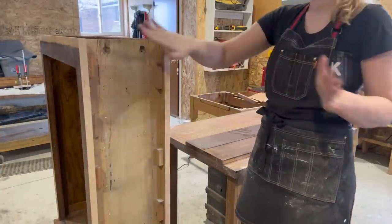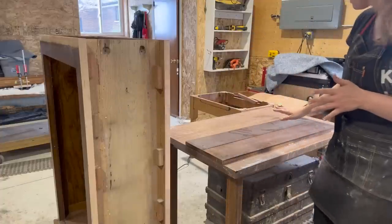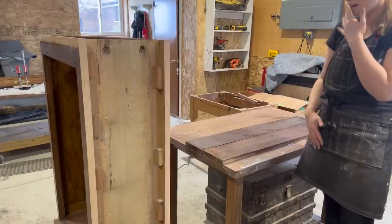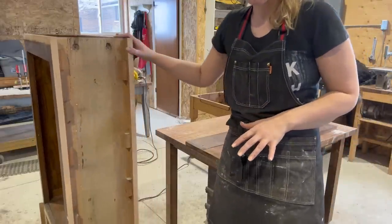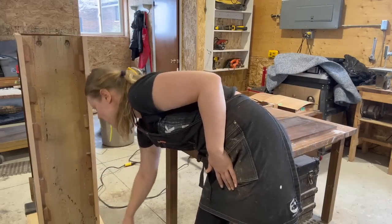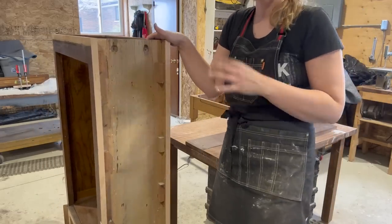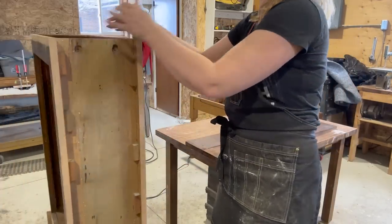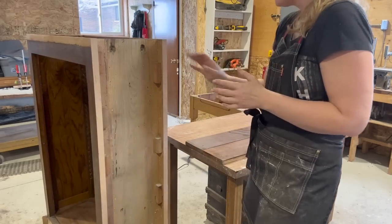So now I gotta think about putting a panel here, and with the wood that the customer supplied me, I can laminate these together and get two sides. These ones are shorter, so they'll only come to about this point down here, leaving about 6 inches at the bottom, but the baseboard is over 10 inches, so that's fine. If there's a little bit of a gap, it'll be kind of like it was on the bottom in the back here. So the other ones go right to the base, doesn't matter either way.